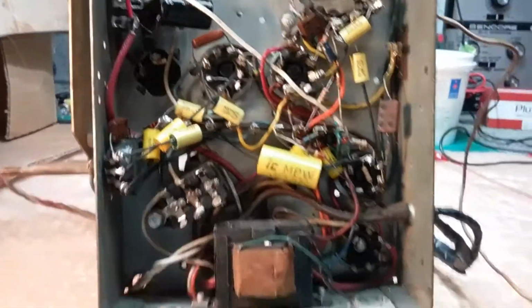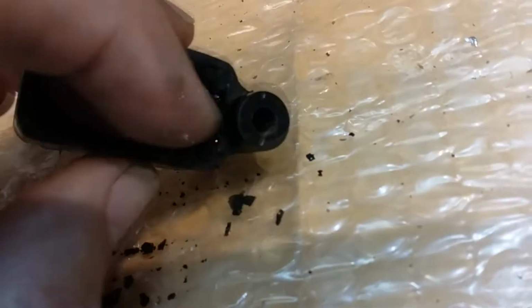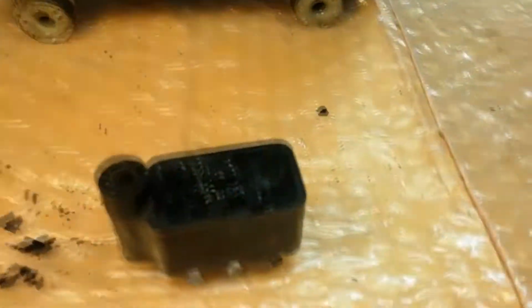Thanks for watching. Well, I figured I would show again these block capacitors and how to get this stuff out of here. Pretty much you got to dig it out. There's no other way. But if you heat it up, it's a lot better. You see it's kind of shiny there where I've been heating it up.